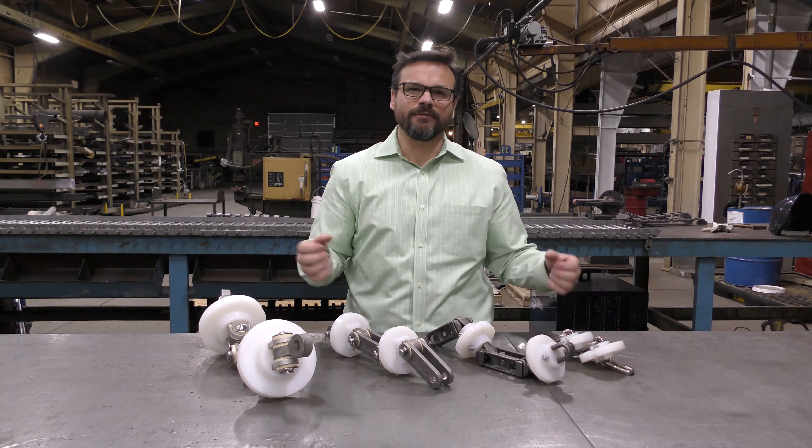With a short pitch chain, you could have some spilling if there's a little bit of buildup, and material will pass from one flight to the next. The sealed pin chain addresses all of those problems. With the same long pitch, it stays very rigid within itself. It keeps abrasive material away from the knuckles and hinge pin. But probably the most important aspect of the sealed pin chain is that each individual link is essentially a master link, so the chain can be parted anywhere and each individual piece can be serviced individually.